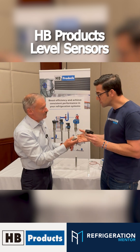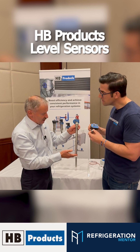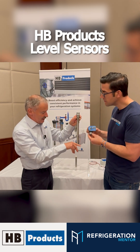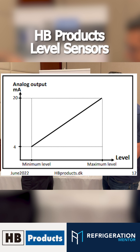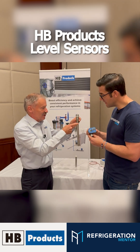And so how does this work? It's a capacitive sensor, which means if you have liquid down here at the minimum point it will deliver 4 milliamps. When it's filled with liquid up here it delivers 20 milliamps. That's how it works — very simple.